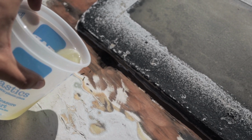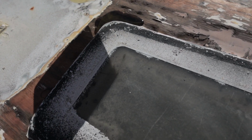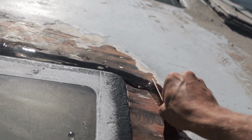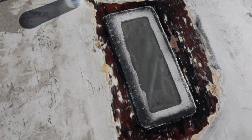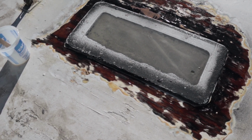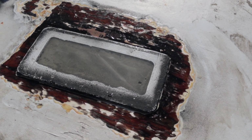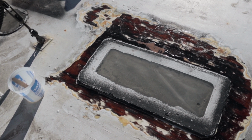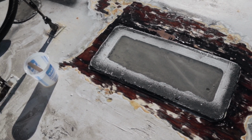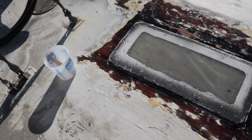We're gonna pour these in most of the wood, let it soak in most of the soft spots, like so. Especially around here. Okay. Got it in. Now it needs to just penetrate, sit. When it cures, which won't take too long, I'll check to see if I need to add any more, because it needs to absorb in and you will see a different color. Obviously a drier color if it hasn't absorbed in. But that looks like it's done what it needed to do.